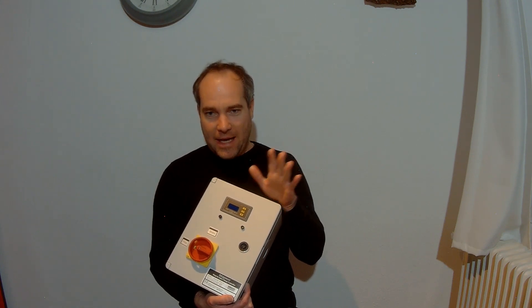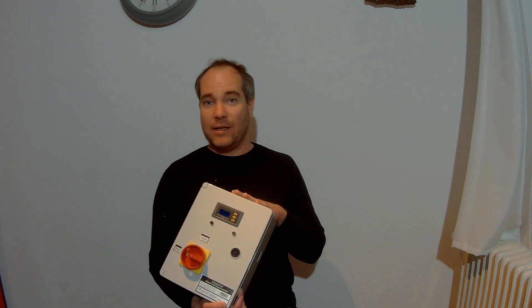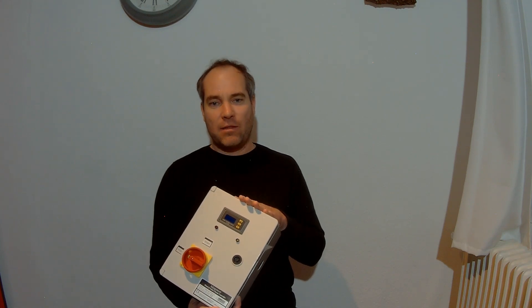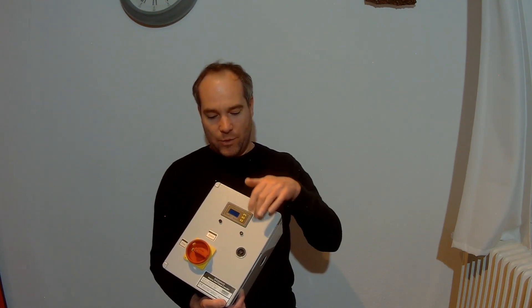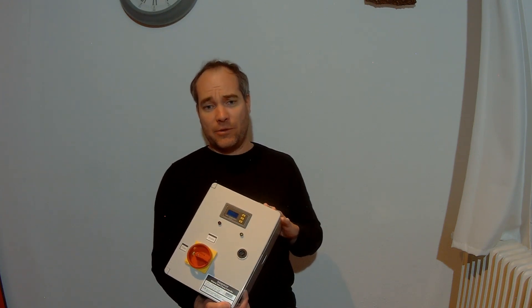I use the Ista Breeze quite often, especially in my windy area, because it definitely survives higher power and peak powers beyond its certified rating. You can just install it and forget it — it works. In case of a short circuit, you have circuit breakers inside. But you have to modify it with an additional controller if you want to use lithium iron phosphate batteries.